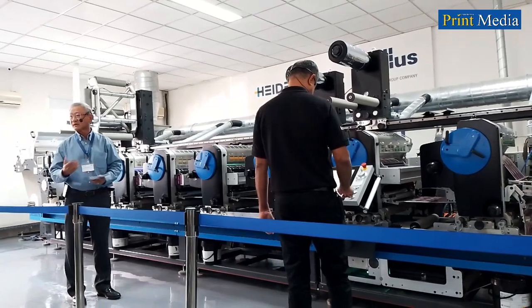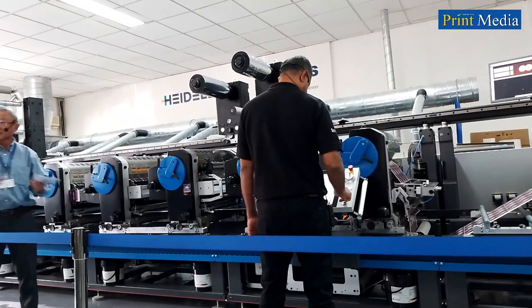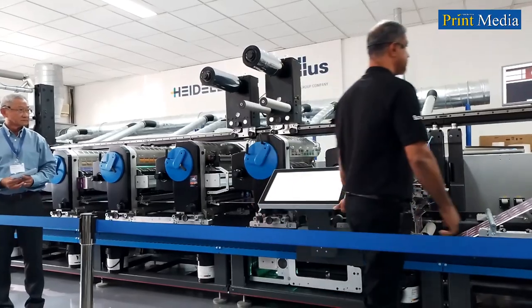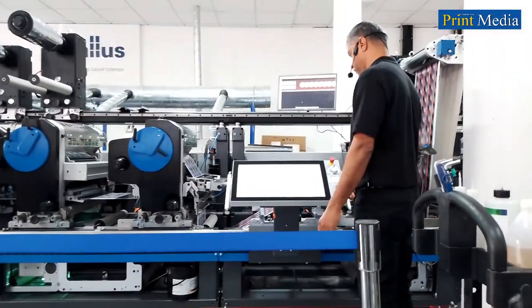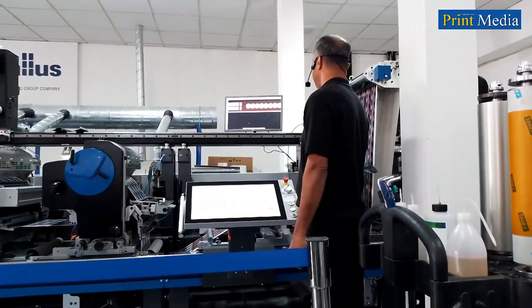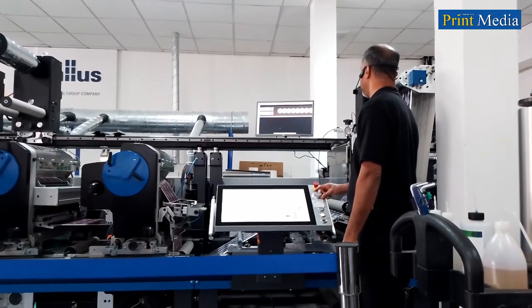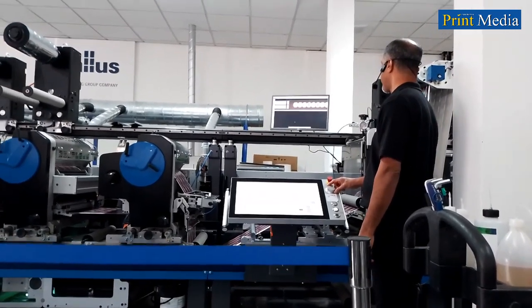We are changing a PSA job to a mono material job, changing with the flex color — disengage and engage. Pay attention to the fifth unit when the register disengages, so the fifth color will be gone. Imagine now we are changing — four colors now — and we are changing the fully packed unit. Without doing any adjustments, the fifth unit color is back again.